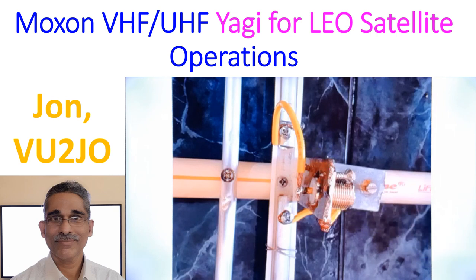What I had to correct was not the dimensions but poor workmanship — I had not placed things accurately and adjusted them later. Cutting the galvanized iron L-clamp was very tough with my hacksaw blade, and drilling the hole for the SO-239 connector was also difficult. I had drilled many holes and tried to collapse them, but finally had to take it to an industrial shop. Eventually I achieved an SWR of nearly 1.5:1 and got the antenna working. I have been able to use it for both VU satellites and UV satellites with fair success.